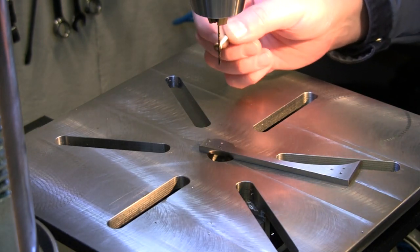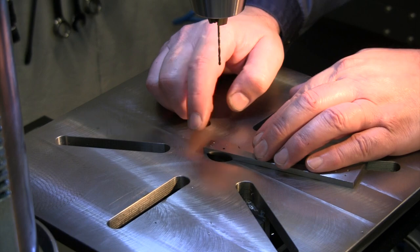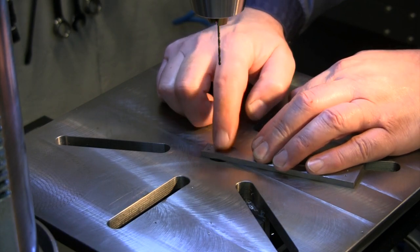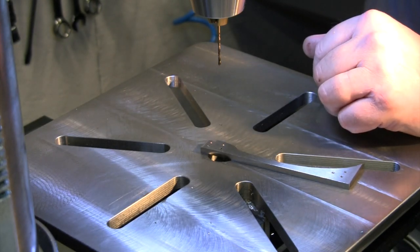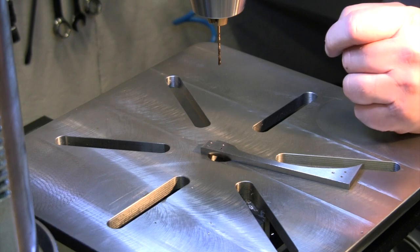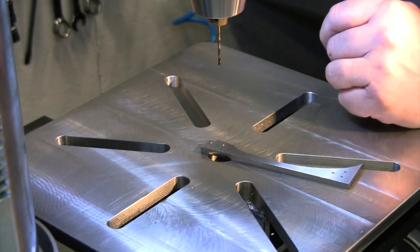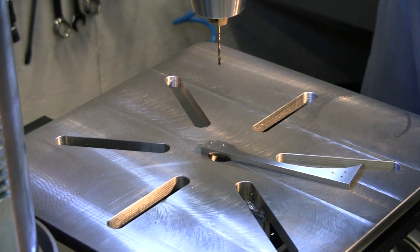All right, I'm forgetting my own process here. I want the oversized holes on the end, and we're gonna work our way over. So I want oversized holes there, the standard number 50s on the inside. And I'm just using Moly D lube again. That seemed to work really well on this tap. One thing I did learn is you need to really shake your Moly D. I hadn't done that last time. All the molybdenum floats down to the bottom. So this time I shook it. It's all a combination, not sure what's making the biggest difference, but again, those last holes tapped super easy by hand. I'm hoping that Tapmatic works well.